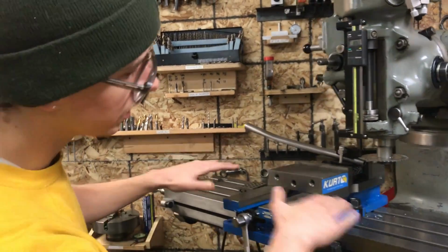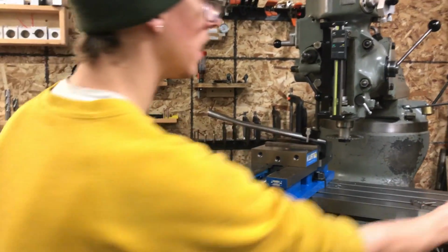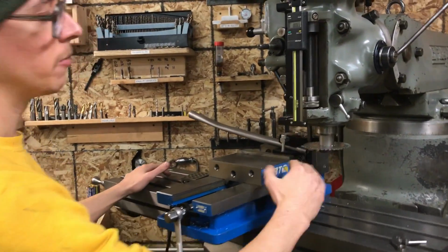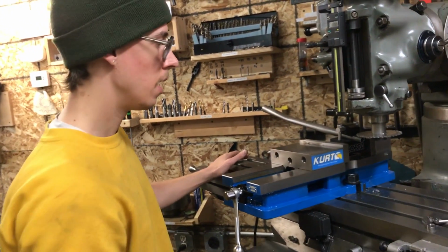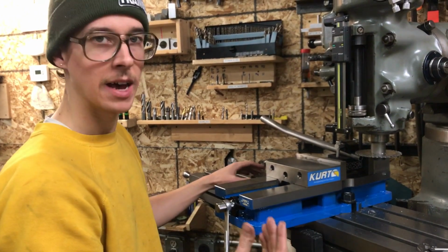And so again, the same way you're going to put the tube in with the same orientation, you're going to set your angle the same way with your digital angle finder. And now you want to make your cut through there so that the slot width ends up being the same as the tab width, plus maybe a couple thousandths for clearance. And so I like to use an 1/8 inch slitting saw. It's 125 thousandths of an inch.